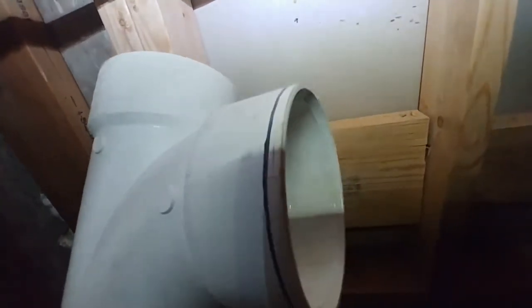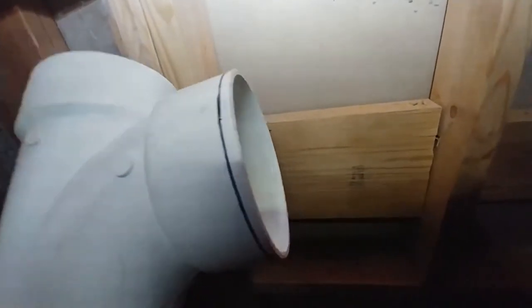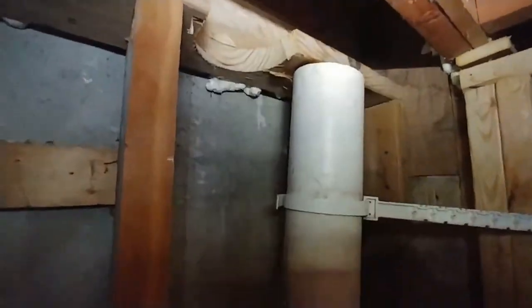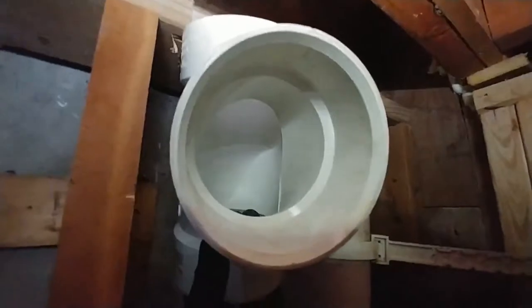Since you can see there's a big taper on that, it just leads in the pipe as you're plumbing it. It's an unnecessary amount of material, and we'll just take it off quick with the oscillating tool. Then we can go back to the back of the notch. Now, normally I would overcut the notch to accommodate just installing the fitting, but as you can see, the notch is as deep as the faux rim joist or whatever. So that would become a case of doing a big, tall hack job all the way up that rim joist that I'm not willing to do.